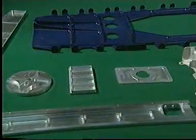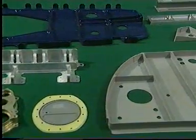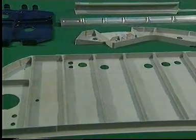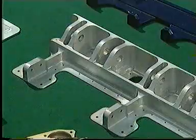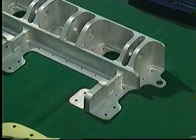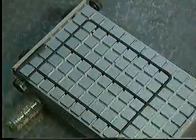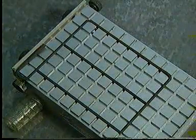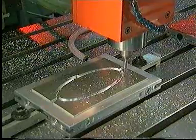Many components, especially those used in the automotive and aerospace industries, need to be completely machined or profiled all the way round and through. They can be held down with clamps, but that entails additional settings and machining only half the component at a time. Instead, double-sided tape or a vacuum plate with rubber seals is used, which is still less than ideal because it entails long and laborious laying up.